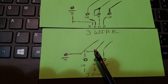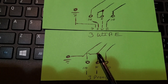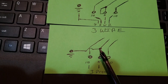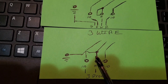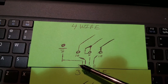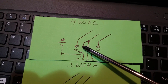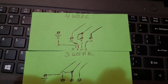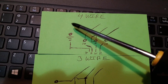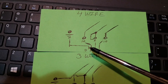The wire on each side is a 110 lead; the center one is your neutral. You're going to want to make sure with this three-wire hookup that you have a ground jumper from the chassis ground over to this center wire — whether it's another white wire doubled back, or a little copper strap that goes from the neutral to the chassis ground. You have to have that. Now on the four-wire it's a little more forgiving. If you make the mistake and leave this neutral hooked up to here it's probably not going to kill you, but it's not the way to do it. The manufacturer wants this circuit to be independent of this ground.